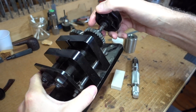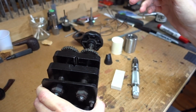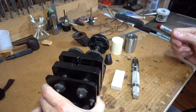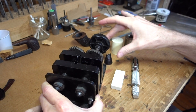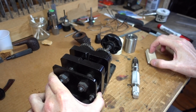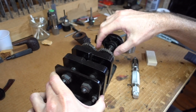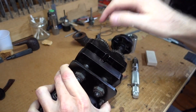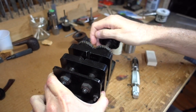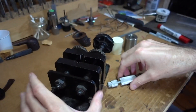The device that I'm holding all this with is a pen vise — P-E-N — like the people who make fountain pens. There are people who make fountain pens as a hobby and as a job, and whereas you'd normally do that on a lathe, it's possible to do it on a drill press, especially for a hobbyist. It's got grooves angled in here to hold a tubular, like a barrel for a pen. I don't use it for that, but it sure is handy for this or similar operations.